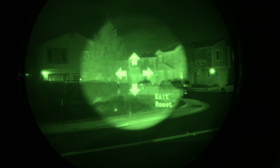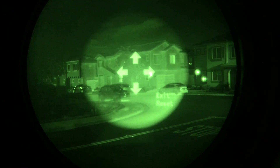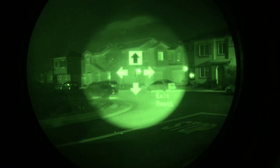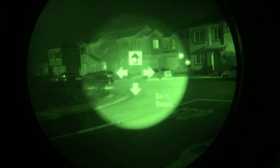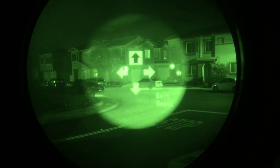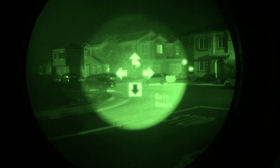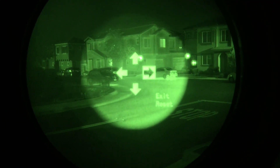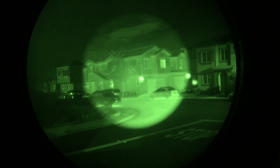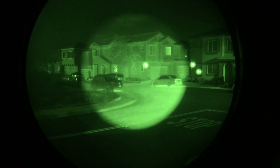Once you're between 85 and 90 percent brightness, press and hold the back button and the secret menu appears with arrows. Using the brightness knob button, push it to highlight an arrow. If you want to move the image up, select that arrow and push the back button to jog the thermal image to line up with your night vision. Keep pressing the brightness button to cycle through and select different arrows. When done, select exit and push the back button — it saves the setting. That's how you collimate the thermal image to overlap your night vision.